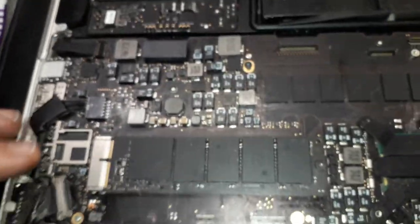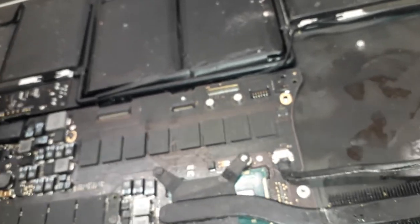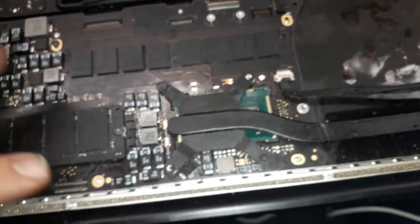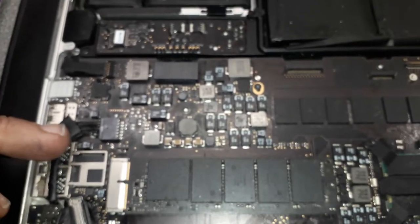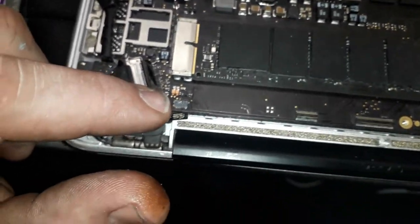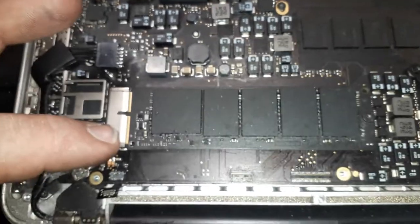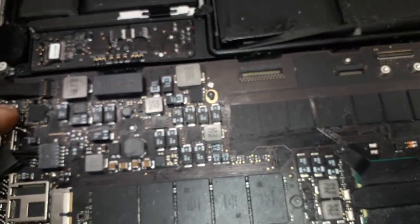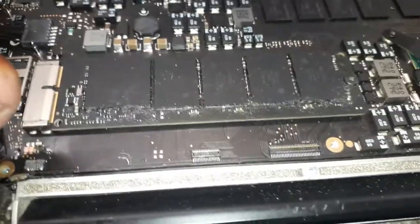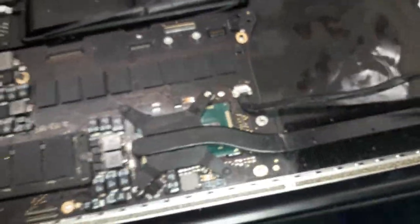Alright guys, I just put the board back together a little bit so we can give some tests, without putting the keyboard on. I don't want to test the keyboard right now. My goal here is, since the board is working, the board now got some quick cleaner. As you can see, there is still some oil, but that's alright. That is actually not even oil, it's my flux. I attached the connector, there's no short on the connector. There's no short in the backlight, of course, if you don't plug this one in, you're going to have to change it. I cleaned the SSD memory, not sure if it's going to work, but I cleaned it. The connector of the battery, the capacitor over there, the corrosion over there. I did a quick clean on the JTAG with thinners. This board, of course, is going to the ultrasonic after, so let's see if the machine is going to work.